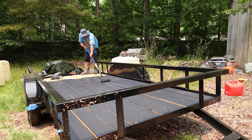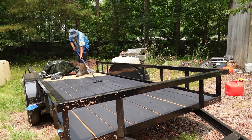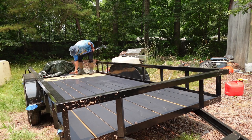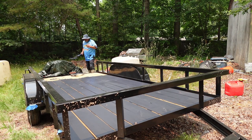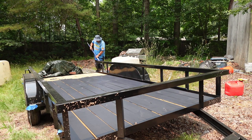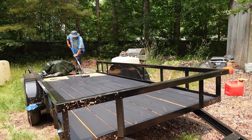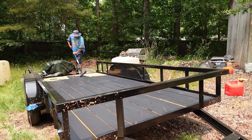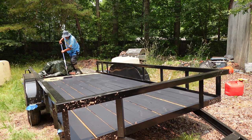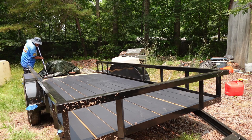This is a huge investment. This trailer — the equipment that's coming — is a 10-gallon-a-minute pressure washing machine, an 11-gallon-a-minute roof pump, specifically an AR-45 roof pump. We have a 425-gallon buffer tank, and then there are two 55-gallon stand-up sauce tanks, or SH tanks, that are going on there.